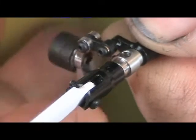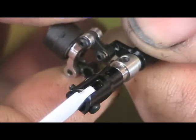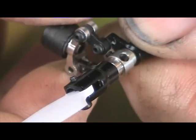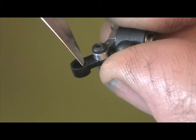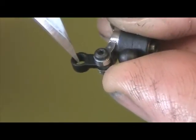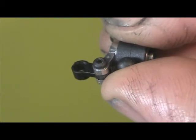Even after all that carrying on, we have a nice free pivot of the link in the pitch slider, but we've still got bind on that bushing even after we trimmed the side length. I'm going to take the X-Acto knife and just chamfer the edge of each edge of the link hole, where there tends to be just a small flash, and see if that helps any.